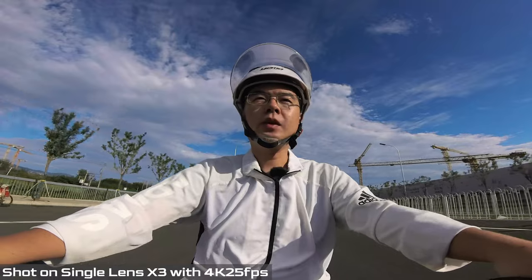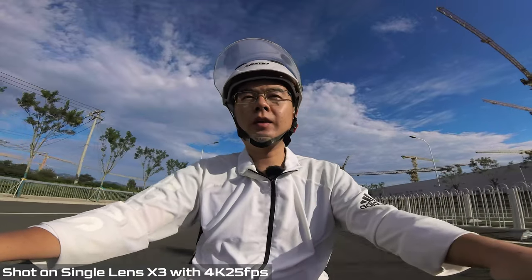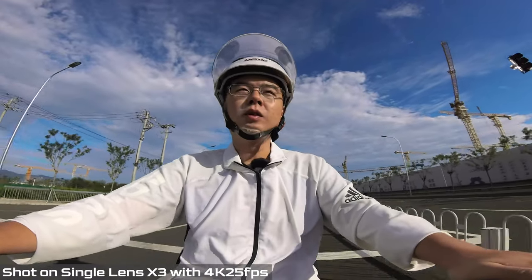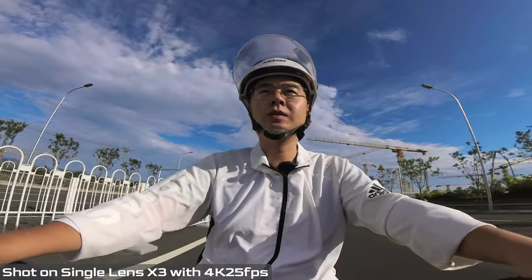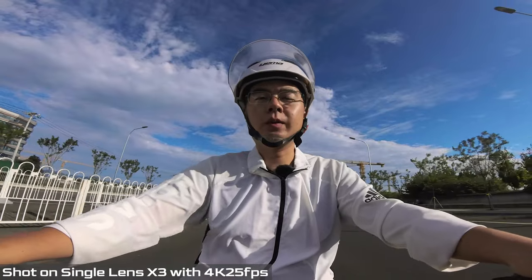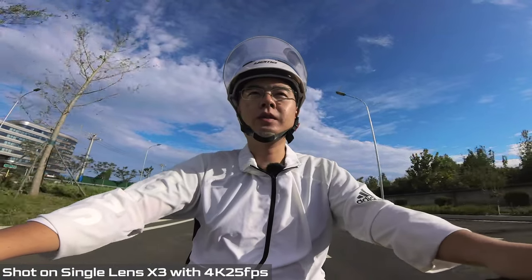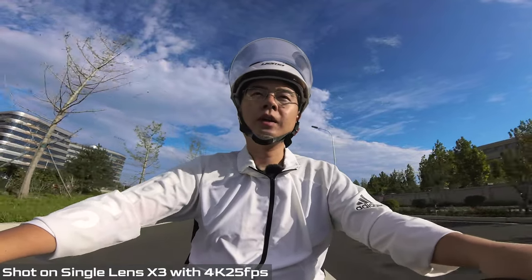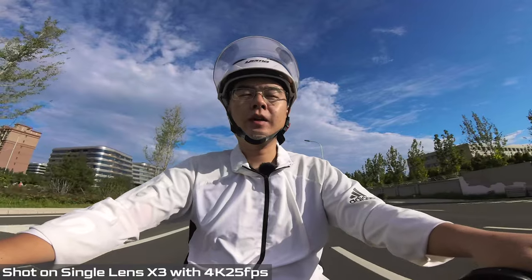You know, the chipset has a maximum data rate for the single image sensor. For the IMX586, altogether it has 48 megapixels, so it's way too large for full pixel readout at 30 FPS. So the engineer chose to read out a section of this sensor plane while still it's capable to stabilize and generate a 4K resolution. But if you narrow down the area a little bit down to 3.6K, now this chipset is just powerful enough to perform the maximum data rate to generate 3.6K at 60 FPS.